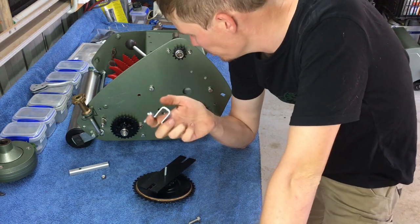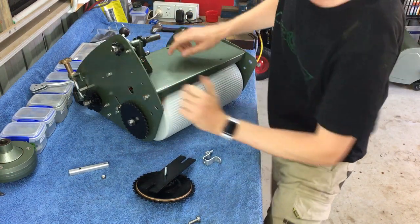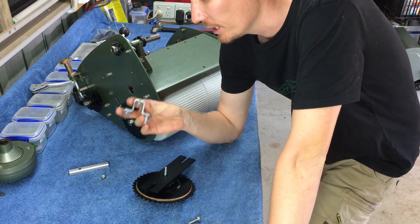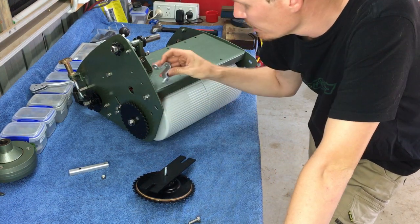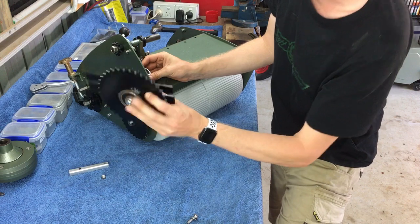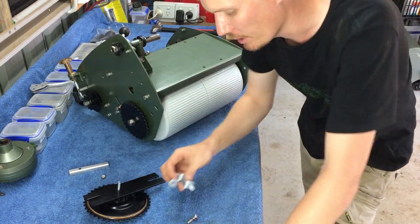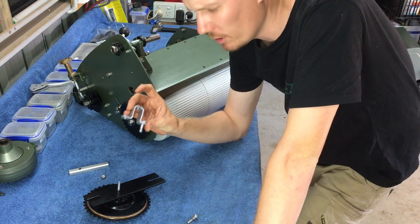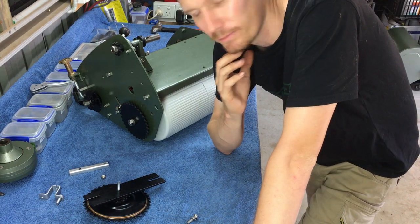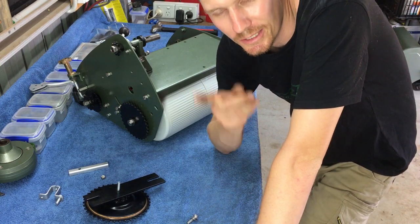Because this is a solid model, they don't have a bracket welded up here on the rail. On the solid you actually have to bolt on your cable holder. This will sit in here, and that's actually the bolt that the intermediate clutch will rest on. If you've got a twin, I don't believe you have this bracket at all - I'm positive it's welded onto the mower. But because I've got a solid, one thing to note is don't forget that, because I've done that in the past and it's such a pain.